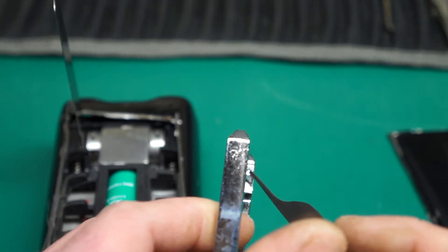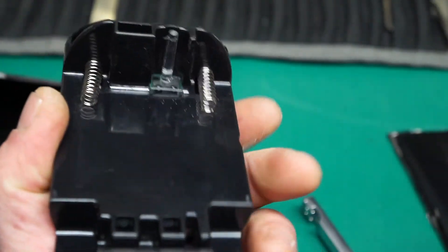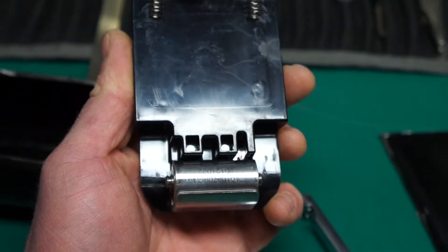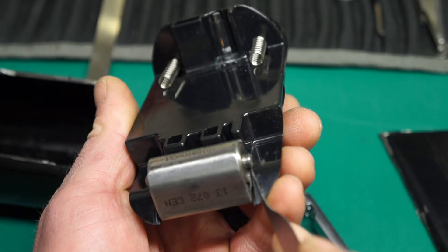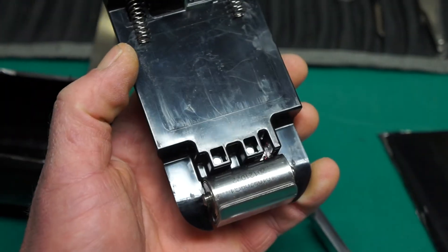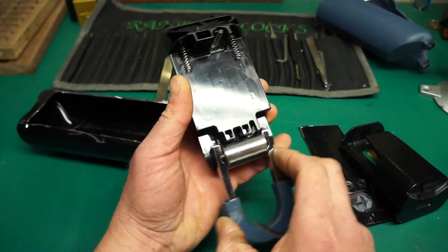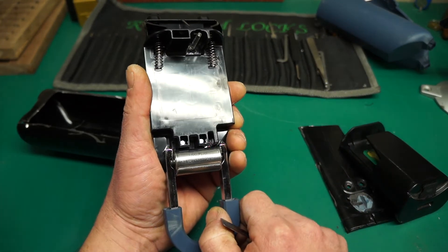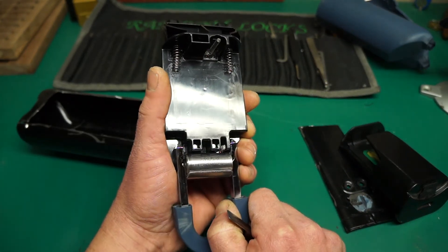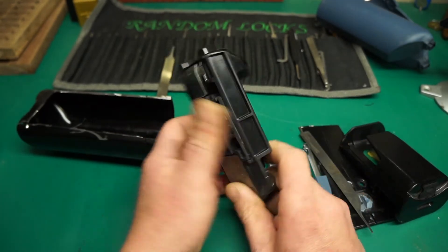This is part of the reason why the hasp gets locked. It has these little clips on here — a piece of steel that's been either brazed or adhered somehow. The plunger isn't just a straight plunger; it actually has a groove in it. So that's what pulls in and clips — just like that. I bet they use the exact same solenoid in two locations. That's why you have to push in first — it holds the solenoid, and then you can pull the hasp out.